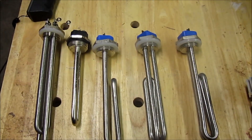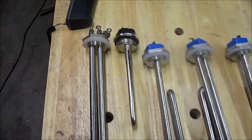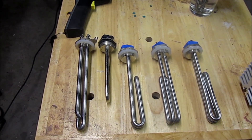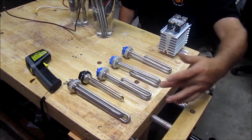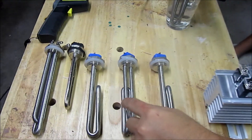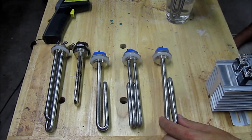I'd like to introduce our new line of hot water heating elements. This is the old stuff we have. This is the new 12 volt 300 watt. If you go out to Lowe's or any home improvement type store, you're going to see what's called a quick recovery element — these are usually preferred because you've got more area in contact with the water for more heating. This is the 24 volt model, 24-300, 48-600, and 48-1KW. We'll be selling these in packs of two, soon with a variable thermostat.